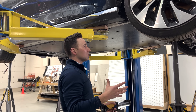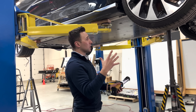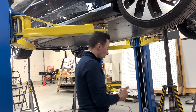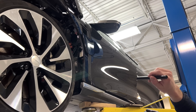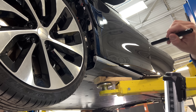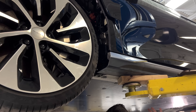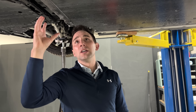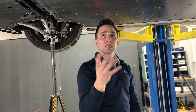If you saw the first video, they did an excellent job maximizing the available space for the frunk and providing enough free crush space in the front of the vehicle. So just another enabler. On the other side, in a similar vein, both the brake lines and one of the coolant lines essentially plug right into the body structure, and then the brake lines traverse inside the sill section for the aft vehicle. What they're doing with that is really maximizing the available space intra-battery pack — how much energy can you carry. Taking some of those other monuments outboard of the battery pack really enables them to package as much energy as possible within the battery.